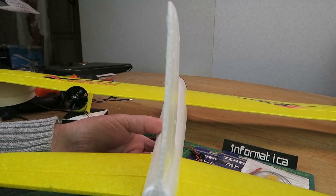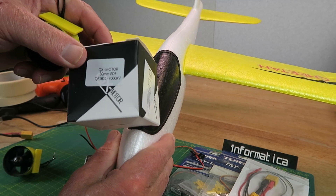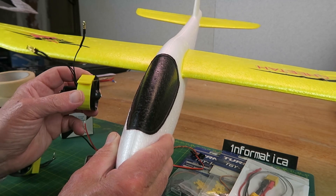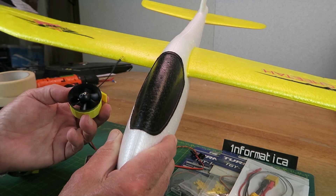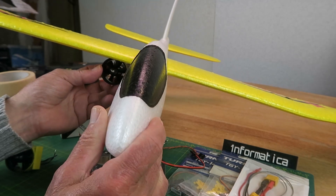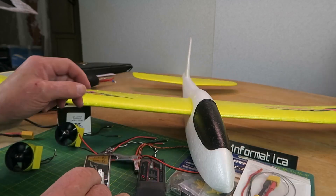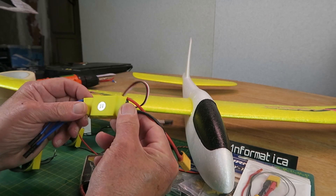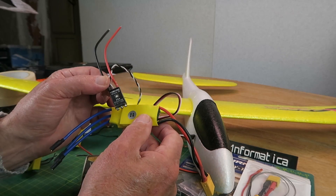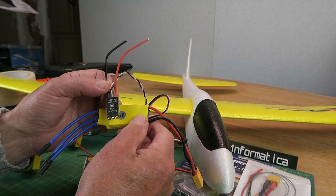The motors I've chosen are these QX Motor 30mm EDFs with a 7000KV motor. I've 3D printed in the same rather fetching yellow a little nacelle holder for the EDF — though I'm not sure yet whether to position it up front, halfway back out on the wing, or somewhere in between; the jury's out on that. Having two EDFs means we'll need two speed controllers. This conventional 30-amp speed controller is way over the top, but this quadcopter ESC at 35 amps is less than half the size — how does that work?